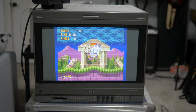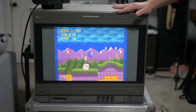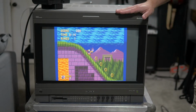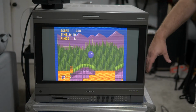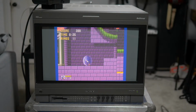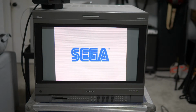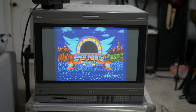Does this monitor support stereo audio? There are no speakers whatsoever in here. So that's the other reason why I showed in that video this week, last week, whatever, having those magnetically shielded speakers right next to it, because that's totally safe as long as they're shielded. And also PC, I showed this particular one with the Bose computer speakers. Those work great. Does this display take VGA or DVI? No, but you can use a very basic converter to convert VGA to RGBS. Or you could use an Extron box, one of the cheap ones. So you could actually feed it a VGA signal.